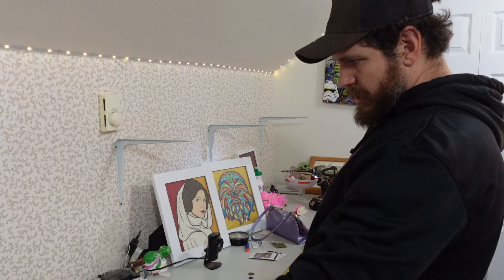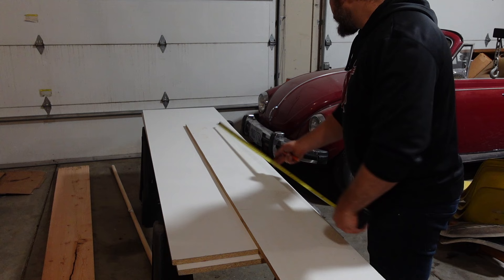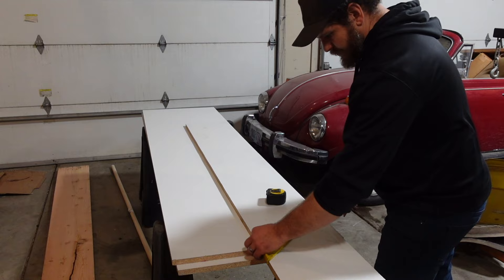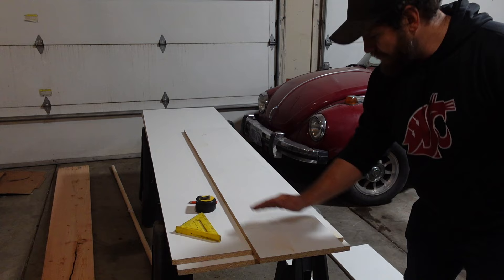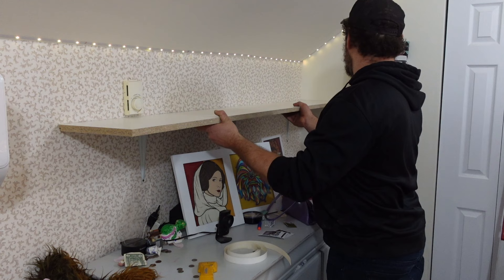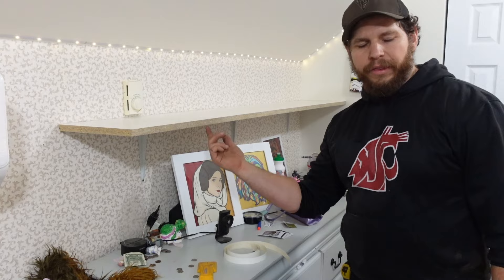Now I'm just going to go full length of this stretcher tight to the wall — 69 inches. So after the edging's on, I'm going to try to get Allison to do that. We've got to put some little screws down underneath here. There are three screw holes on each bracket to go into the shelf — that'll just keep this from sliding around. So let's move on to the next one.